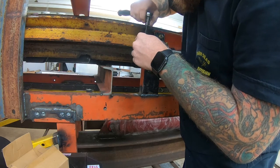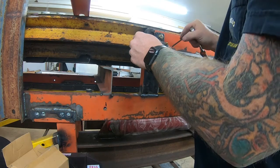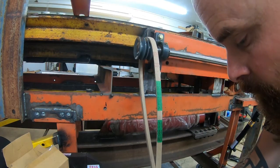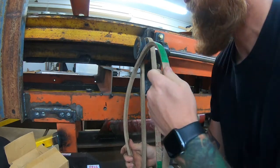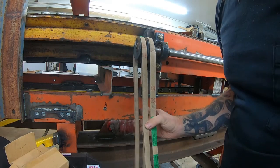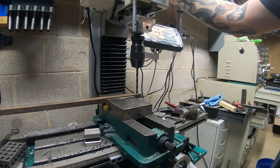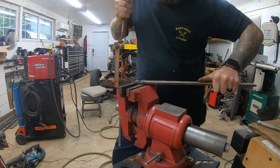In the previous video I had a gap issue with my pulleys, so I got two single pulleys and was able to gap them apart so that the belts would line up with the drive pulley on the engine. I did find a calculator online — you basically put in your pulley sizes and your center-to-center distance and it tells you what belt size you need — so the belts worked out.